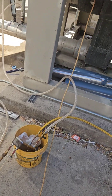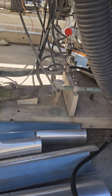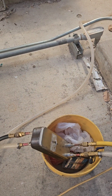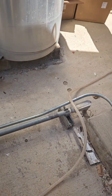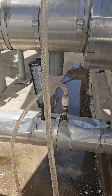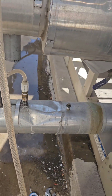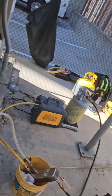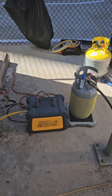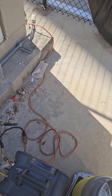Got the sub-cooler going, working on this chiller. Going to be doing TXV to EXV conversions. Got the sub-cooler going and I am using the supply and return water lines. This fitting right here is junk but there's very little wastage, and I'm using the pump to help me out. Got the MR-45 going on.